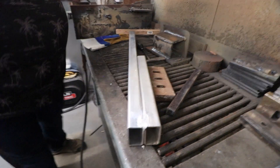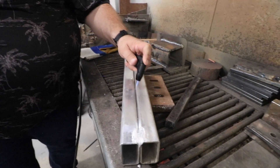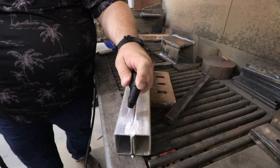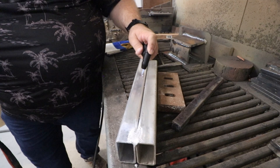When you're welding aluminum, it really likes to be preheated. I'm just using this as an example of how to preheat that gap. It will do a way better job if you preheat that aluminum — just a little bit of propane or butane torch. That's all you need is a little bit of preheat.